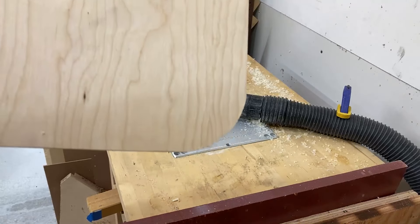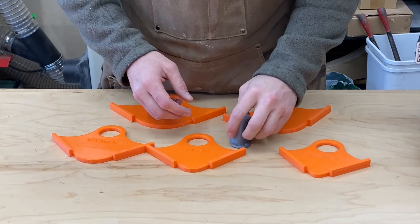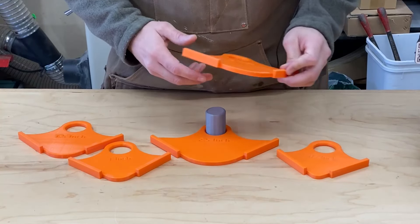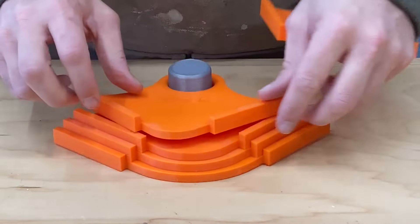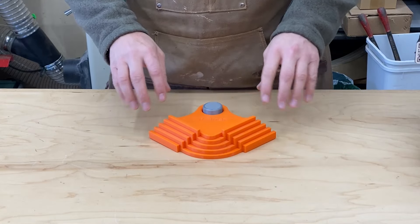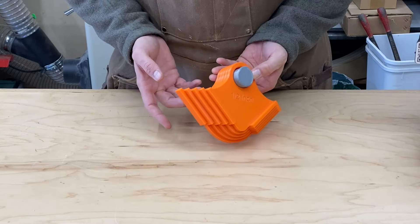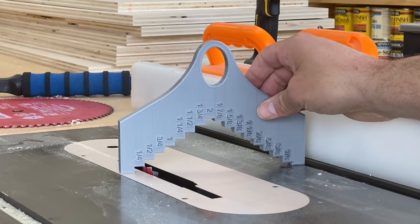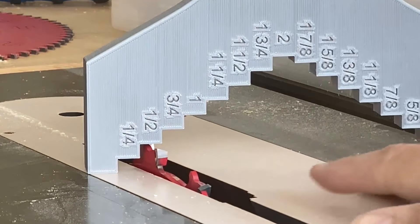I designed these because I wanted to make them more compact. I also designed the holder here, which allows me to store them so they sit into each other and I can hang them, which I plan on doing in this video. This was a learning experience for me and it allowed me to learn how to use Fusion 360, which is a more professional program that I'll get into later on. But again, super useful — you don't have to design it yourself, but if you wanted to, you could. This is a step gauge and it basically allows you to get the perfect elevation on a saw blade or on a router bit, in case you're trying to cut dados and things like that.